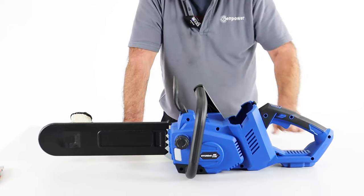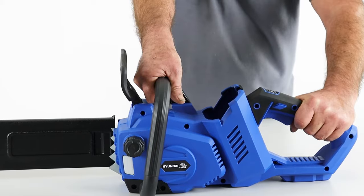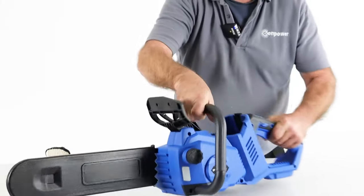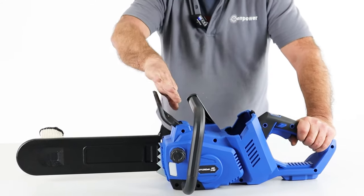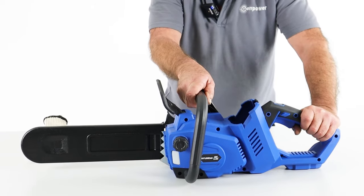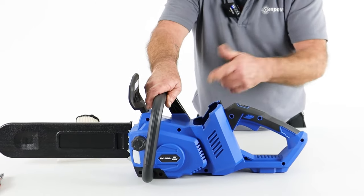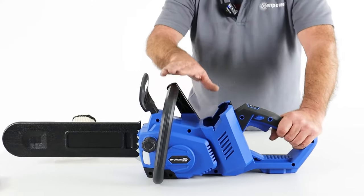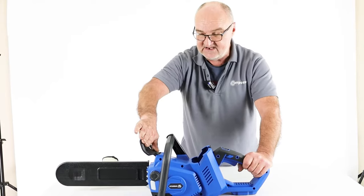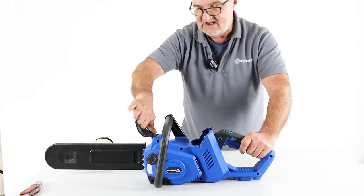Now that we've done pretty much all of the assembly, I'm going to show you some of the controls and safety features. Most importantly, we have this lever. When operating the chainsaw, should you have a kickback, the tendency is for the saw to kick up, and your arm would bang this lever, which cuts the power to the saw. On a petrol chainsaw it would be called a chain brake with a mechanical brake attached. This is an electrical interlock: when pushed forward, no power goes to the chain and it stops. When pulled back, it's in the armed position — that's when the chain will rotate. Always leave this lever in the forward position when transporting or not using the saw, so if you inadvertently pull the trigger the chain won't start unexpectedly.